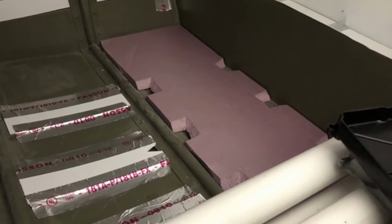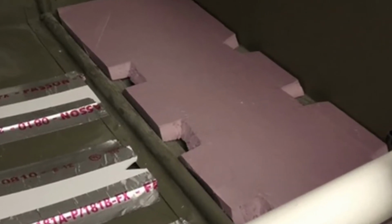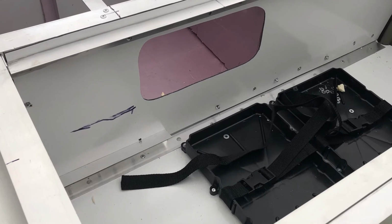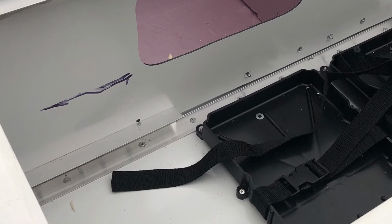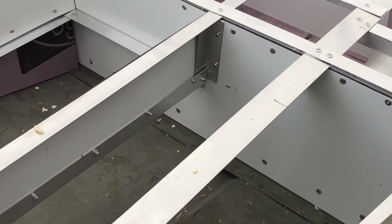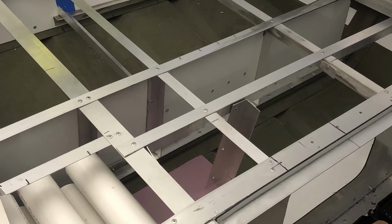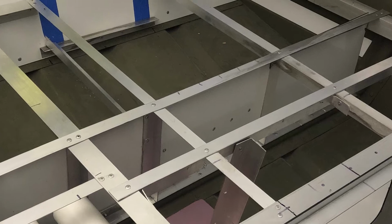We begin by cutting and placing 1-inch thick EPS flotation foam, making sure that there are cutouts for water to drain into the bilge. A layer of 1/8 inch Piedmont PVC signboard is cut to form the bottom of the forward lockers. Bulkheads are built and installed with rivets over the Tracker structural ribs. 1.5 inch and 1 inch aluminum angle is used as stringers to connect the bulkheads together and to the hull.